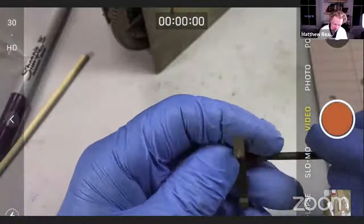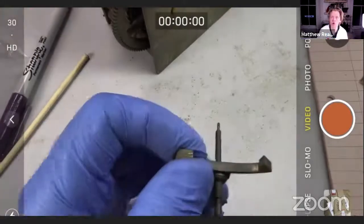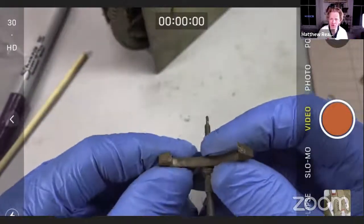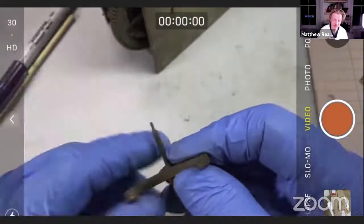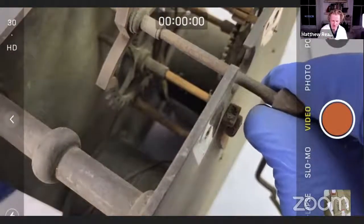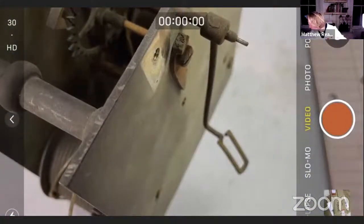Pallet faces, a little bête noire. They look actually amazingly unworn. So I worry that somebody's done that thing of polishing out the wear, which of course, in my view, as you know, is just another form of wear and it just increases drop. So, but we've tackled refacing the pallets, as you know, so we can do that with our eyes closed nowadays if necessary. Come on. Let's just have a look at drop.